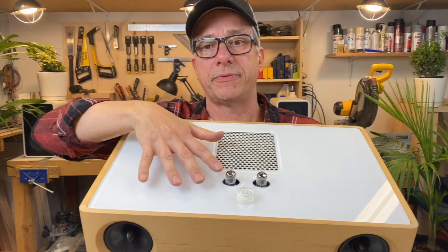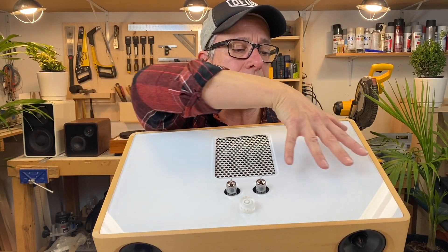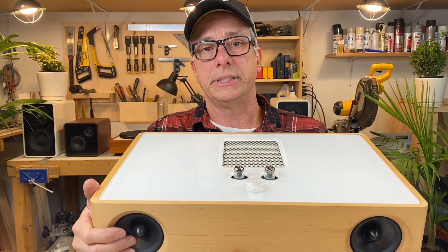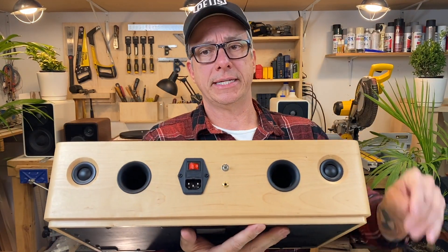This is the top of the Redondo speaker. I have a speaker chamber here, an amplifier chamber here, and another speaker chamber on the other side. We have two full-range drivers on the front. On the back we have the ports and the tweeters — I added tweeters on the back because I didn't want them on the front. The main drivers deliver highs but you have to stay on-axis, so the tweeters help fill the whole room.